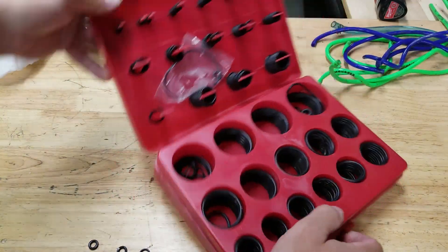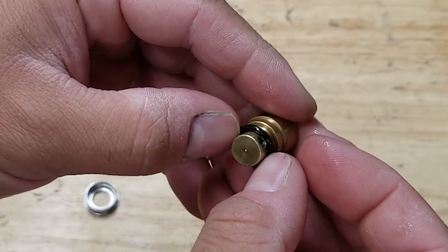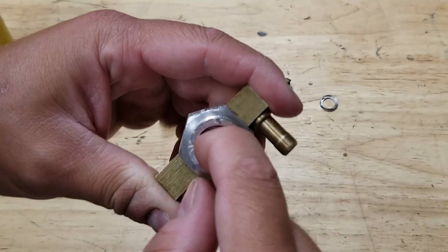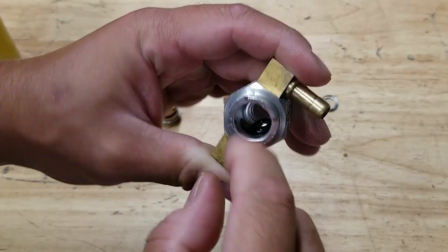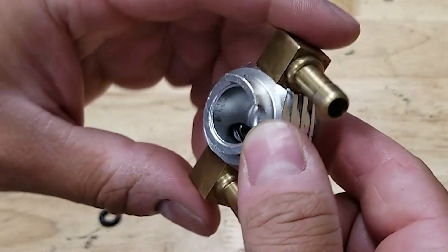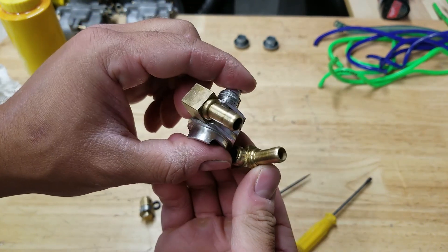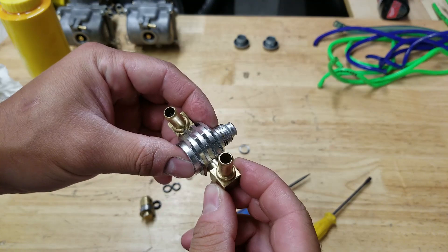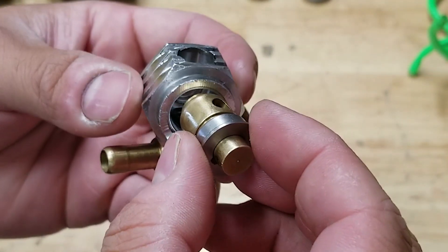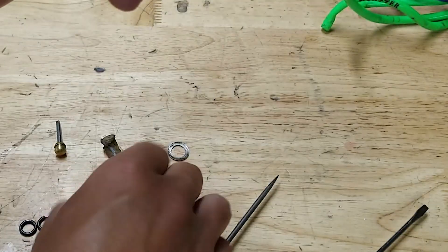Let's see if we can find the right size o-ring — that looks about right. This might be a little difficult getting these to stay in place. I imagine when these are assembled, these two fittings are pressed in with the o-rings. It turns out that these two little outlets actually do come out — I just put this in the vise and twisted it out with an adjustable and it looks like we'll just have to press it back in. Instead of taking both of them out, I'm just going to get the one o-ring in, then drop a new o-ring in and press this in place with the vise.